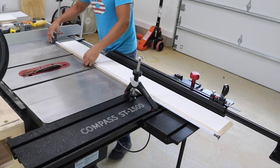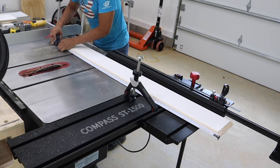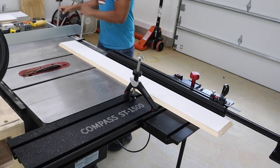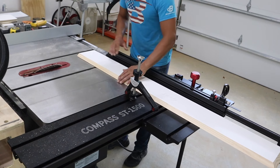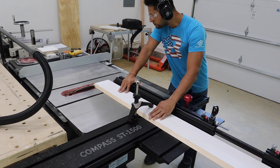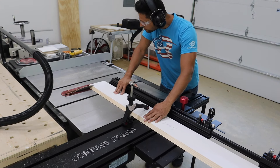You're going to see this in the upcoming video for the closet built-ins on a walk-in closet. It saves me a lot of time on bigger panels, but it's also very accurate on smaller cuts. You can go and bevel your miter saw and do it there, but since I already have the blade beveled to the correct angle, I'm just going to cut it right here at the table saw and save a lot of time.